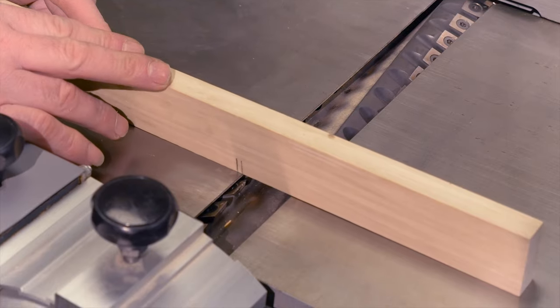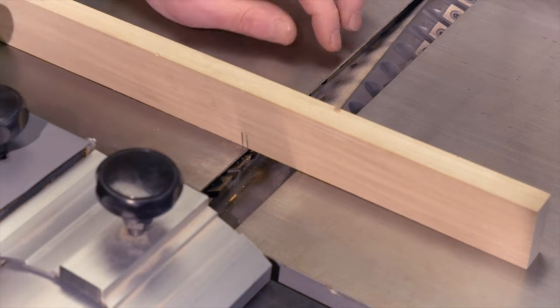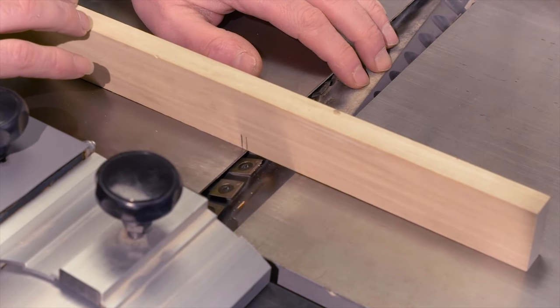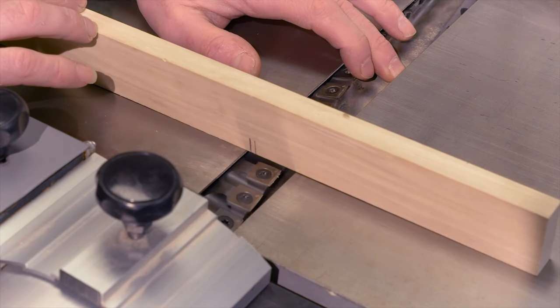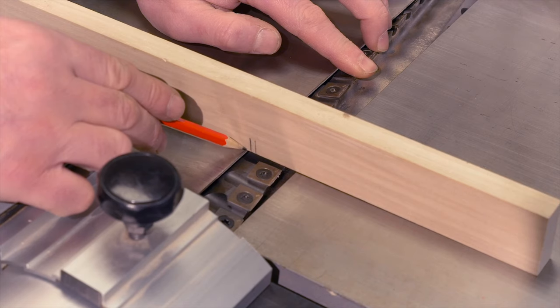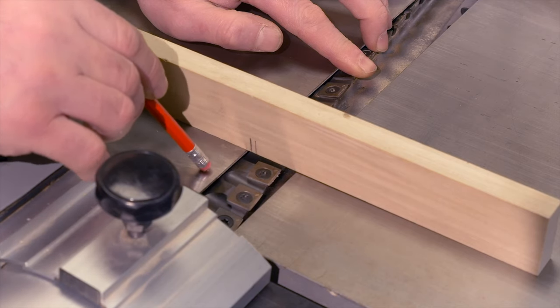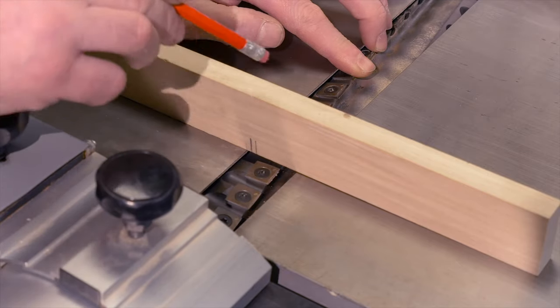We're just gonna put our line in line with the edge of the table, our first line here. And then we're gonna rotate the cutter block and it picks up a piece of timber and then drops it. Well, you can see here, we've just dropped just past our second line. So we're not the 3 or 4 millimeters, we're more like 6 or 8 millimeters. So that tells me now that this particular side of the cutter block is too low and I could end up with sniping if I'm machining in this area.